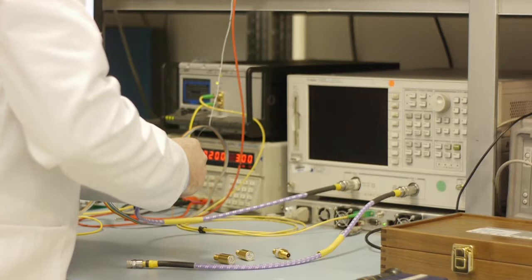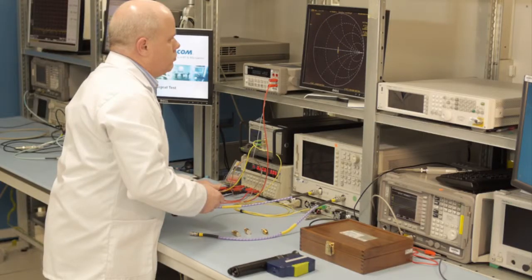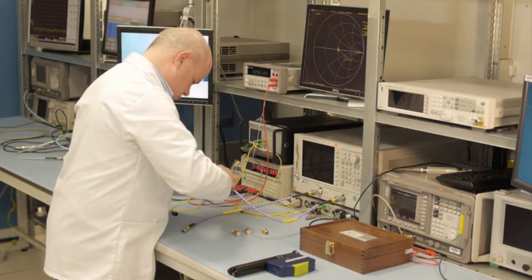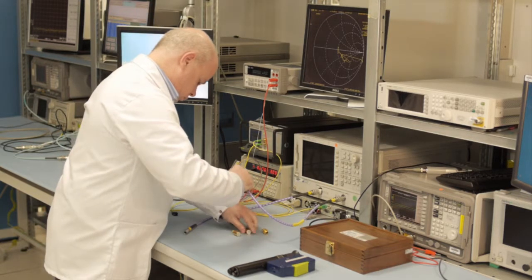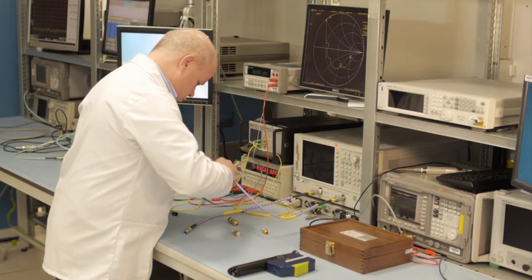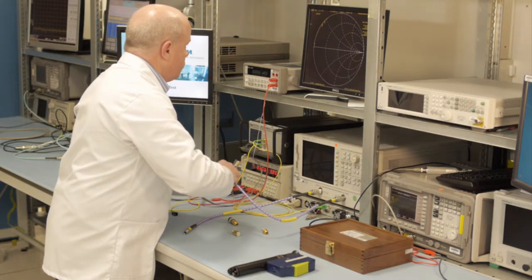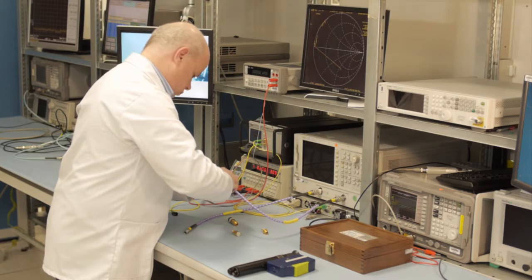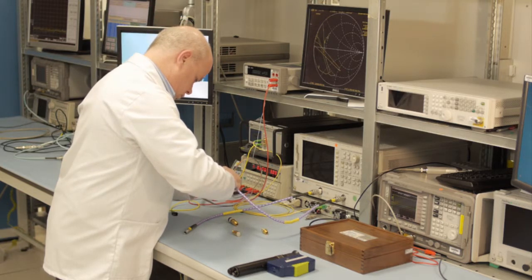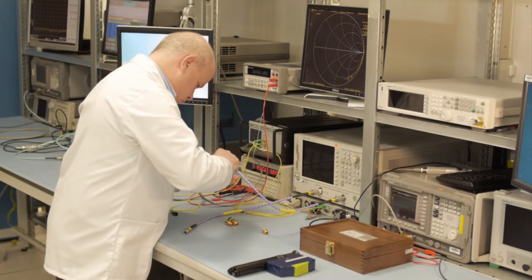Transimpedance gain of the FTTx amplifier is measured on a vector network analyzer, which is referred to as a VNA in the rest of this video. The VNA shown here is Agilent's 8753ES, which is a 75 ohm analyzer. The RF test cables used are 75 ohm type N to type F and can connect directly to the VNA ports, DUT and laser transmitter without the need for minimum loss pads.